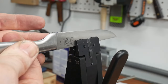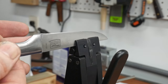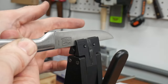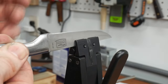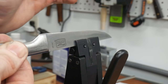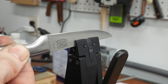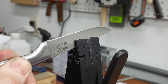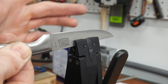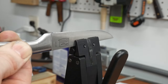There's a lot of literature on where to put the knife in the vise. Basically, it comes down to where the blade starts to curve — wherever that curve starts to happen, you want that at the front, and that's a good place to start. When you test where your stones are contacting the secondary bevel, you can make adjustments. In some extreme cases you can cant the blade up or back, depending on where it's hitting on the front or rear.